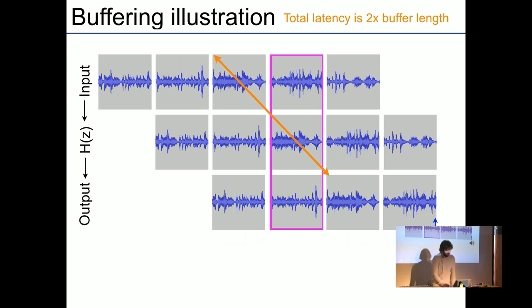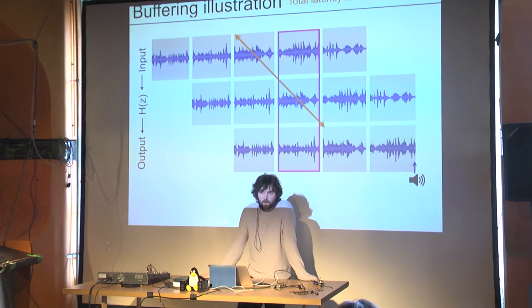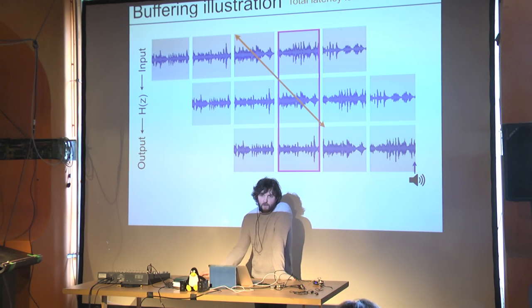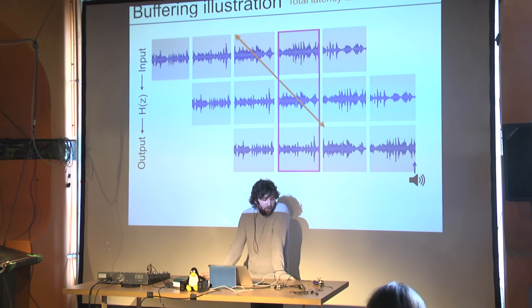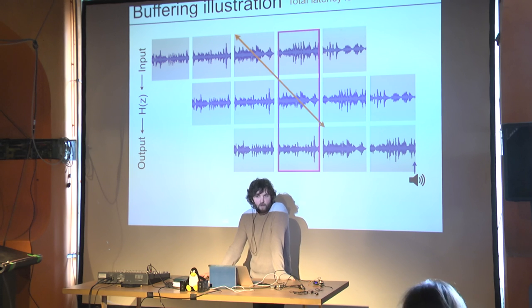This shows simple double buffering: you have one buffer of time to do your computations while something else is reading the inputs and writing the outputs. The reason for choosing the BeagleBone Black was its onboard microcontroller called the PRU — Programmable Real-Time Unit — inside the same chip as the ARM A8 core. The PRU runs at 200 MHz, has a limited instruction set, and can share memory with the main ARM core.